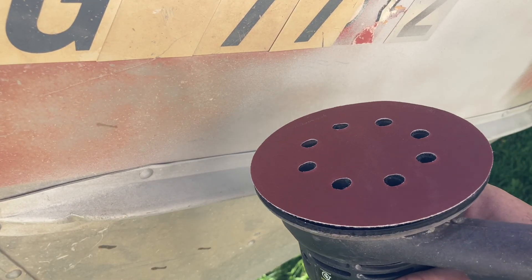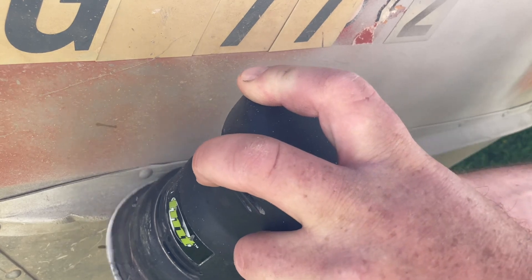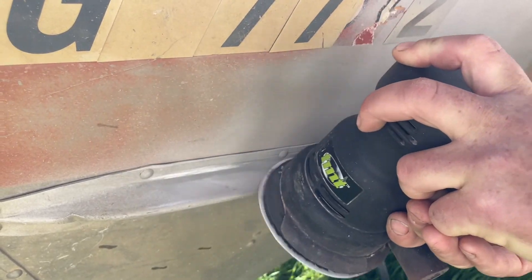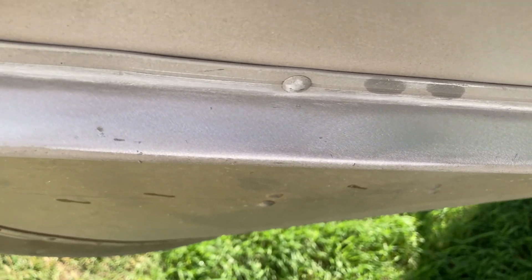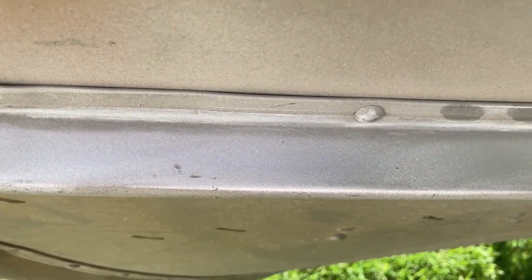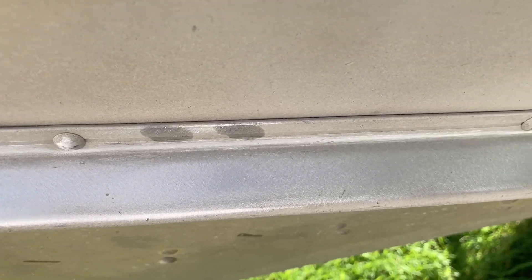To give you an idea of how this polishes up once the spalling has happened from the sandblasting, I've got this random orbital sander with 220 grit sandpaper. You can see even with the 220 grit, you get a bit of a hash mark pattern going on. So I'll hit this with a cutting compound on a buffer and that should come out real shiny.